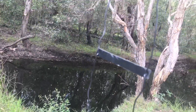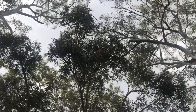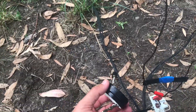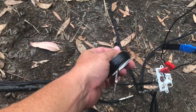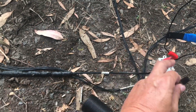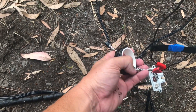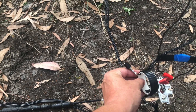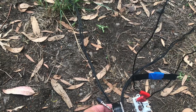The 20-meter element finishes about halfway and the 40-meter element goes right to the top of the 10-meter pole. I've got two little inductors — this one's about six winds around a bit of PVC pipe. To use that, I use the 20-meter element, leave the 40-meter unattached, plug the 20-meter into the banana plug socket, and that makes the 20-meter element a little longer to tune up for 30 meters.